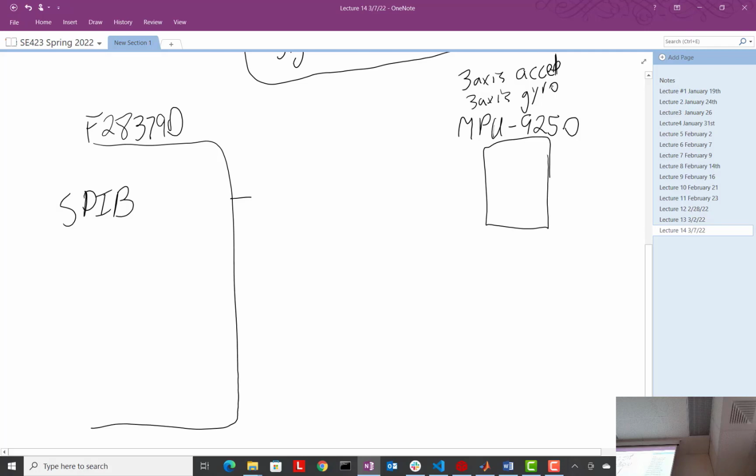But before that, I want to talk to you about another chip, just so you get the idea of how we look at the data sheet and figure out what we need to send over to the device and then how we send that over to the device. We actually don't have them soldered, but on the green board of the robot, there are 4 chips that just aren't soldered, LS7366 chips. If I needed to in the future, this would allow me to add more optical encoder channels.